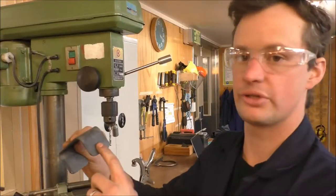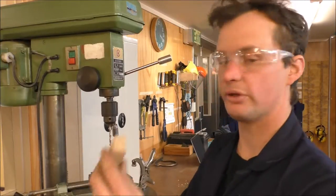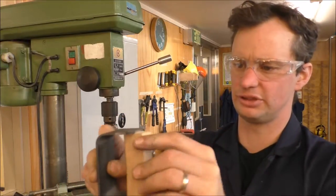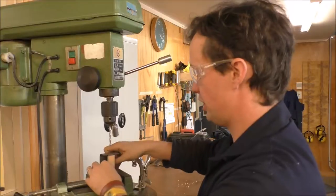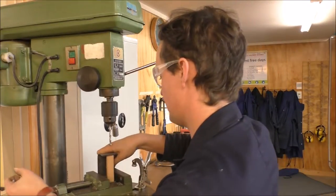We're good to drill these 10mm holes for the pins to go through. But before we do, it's a really good idea to create a small block that's a nice tidy fit to sit between it, so that when you start drilling through it won't compress and bend your nice 90 degree angles.